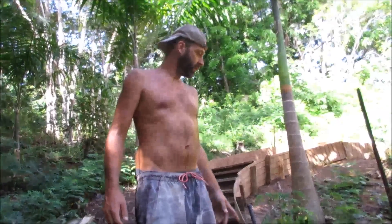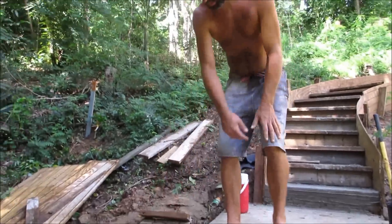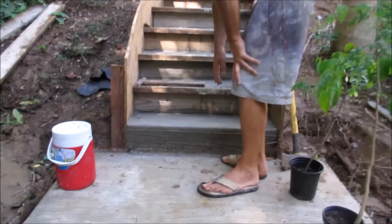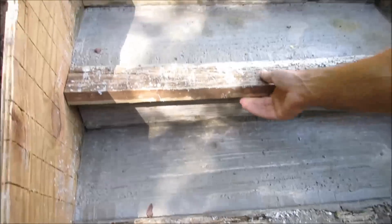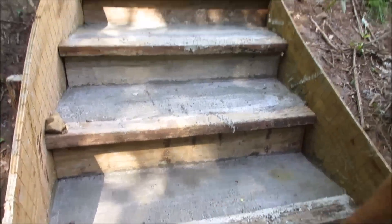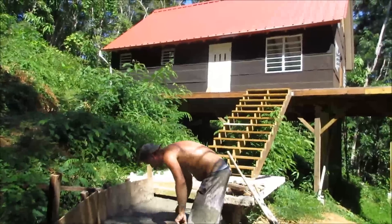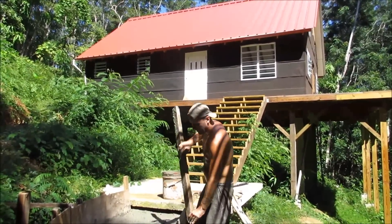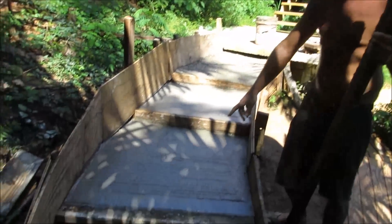So we've taken the forms off of the concrete that was already poured — all of it's now exposed and turned out pretty good. We're starting on the next phase of the stairs. I took the first form off the stair, and as you can see these are all filled in behind — the wood was keeping it. You just take it out, and we'll get done with the rest of the staircase hopefully soon. This is the final stair that poured today, and this kind of completes the process.